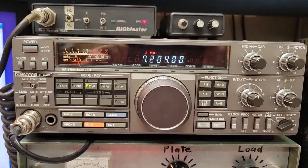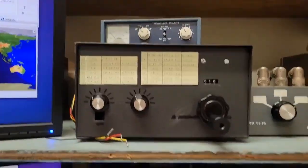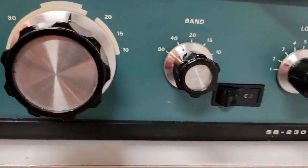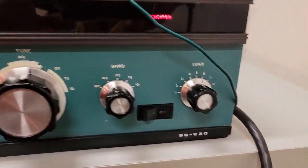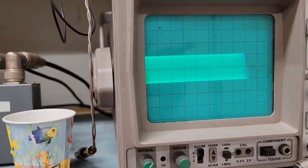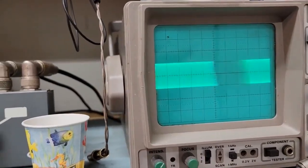The rig is on an unused frequency — 7204. The antenna is tuned up for lowest SWR. The linear has been adjusted for this particular frequency; I am on the 40-meter setting. Dial indicator is in the range where it should be. I've loaded up the antenna. First of all, we'll show this is the 100-watt carrier reference — it's one division off center.